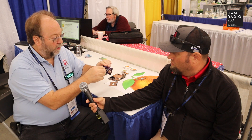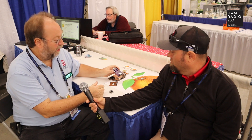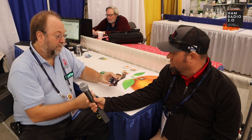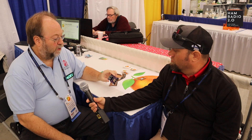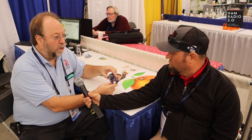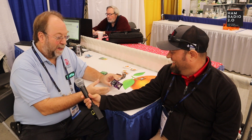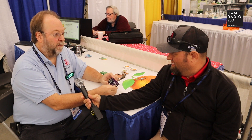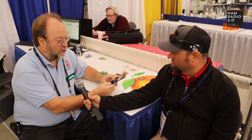We connect it to another copy of the board, only we don't put a sensor on it. We re-strap it and it becomes the receiver end, and hooks to the Tangerine. So now we've got a remote magnetometer, which you really need because you can't measure these fine fields inside your shack with all the electrical appliances going. We've got this mostly working, though we're not really sure what the results should be — we can read the data but we're not sure if it's working correctly. So we're going to place some of these at a state park in New Jersey that has official instrumentation magnetometers, and compare our results to the official thousand-dollar ones.